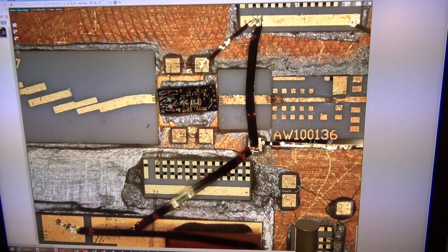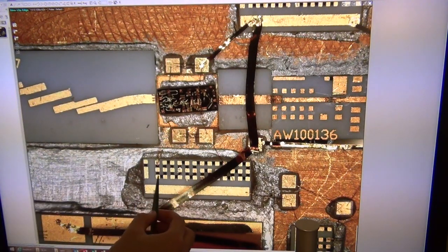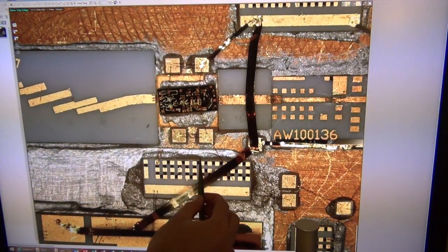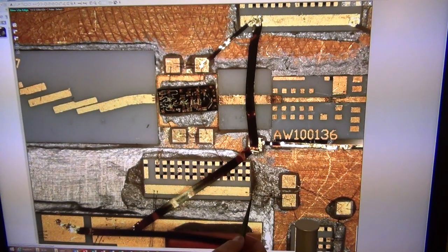Let's say I want 50 ohms. Then, let's say each of these is 5 ohms. I take 10 of them. And if I want something else, let's say I take a different amount. So you can see they've tapped off here. So they're using this portion of it. This is actually two different resistors, I believe. So here you can see this snake pattern here and ends here, and there is another one that ends here, and there is the ground connection at the bottom. So there's a bunch of different things you can do with this type of material.